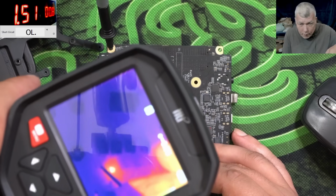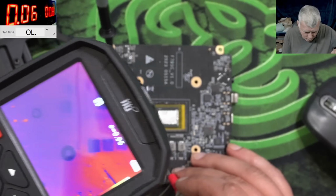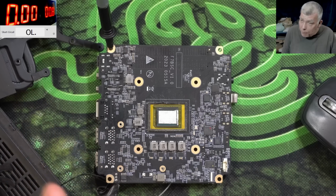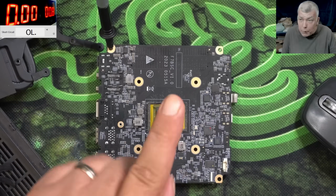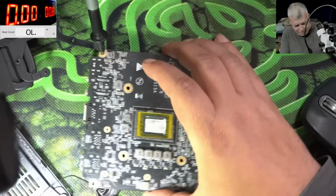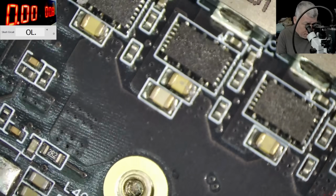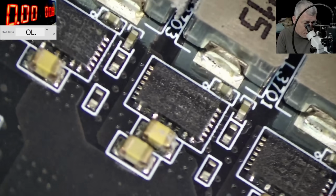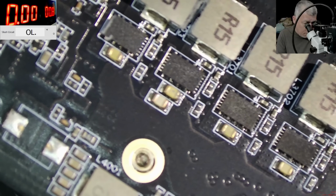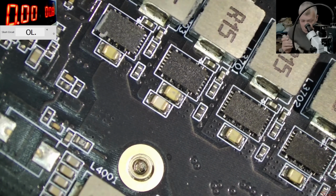So with the thermal camera, what is that? Wait 1 second. It's a capacitor, that's crazy. So basically, you see, the capacitor which got burned is actually where we have a DrMOS with 2 capacitors, yeah? The places with 1 capacitor are fine, no issues. Can be a coincidence. I mean, yeah, check there, you can see it. Yeah. And we have that kind of monolithic drivers. A694, yeah, classic monolithic drivers, very good, very good. The solution is a shorted capacitor, like usual.